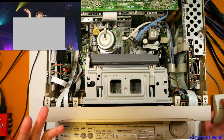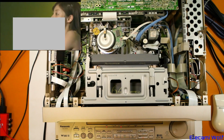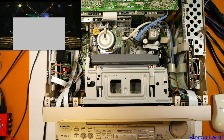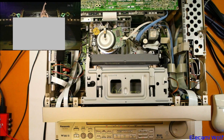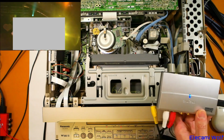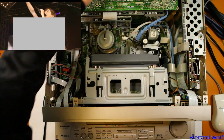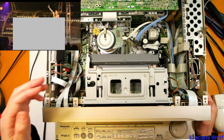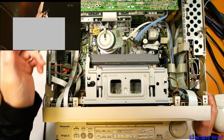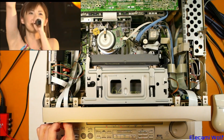And there's also no ducking on that input because I was using it for other things. But yeah, because it has to go through the amplifier to get the component turned into HDMI, but then the amplifier doesn't put the audio into the HDMI, so I've got to capture the audio separately. So that's coming in through this thing here on another channel, but that's okay. It's from one of the other outputs of the VCR, since I got quite a few, two composite and S-video outputs with accompanying audio, and then the component output, and that's got its own audio. So there's 3 sets of stereo audio outputs from this machine, and there's also a headphone socket on the front with its own volume control.